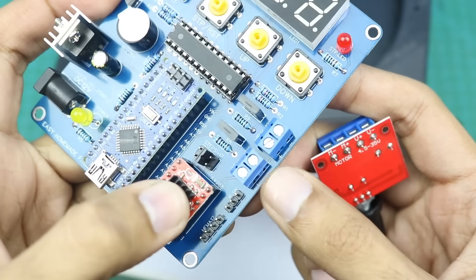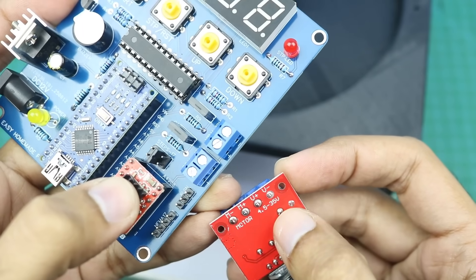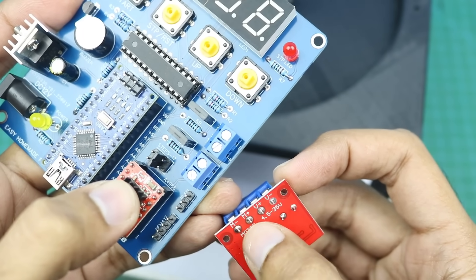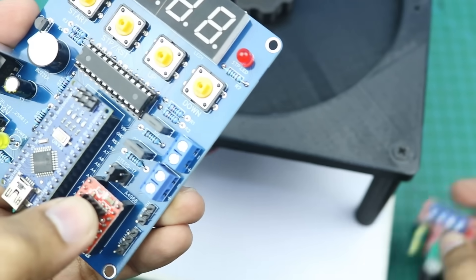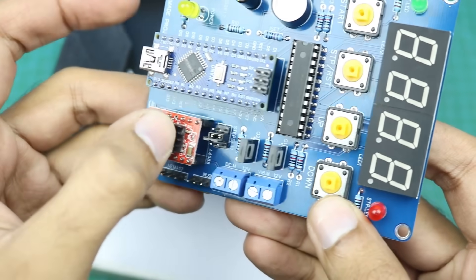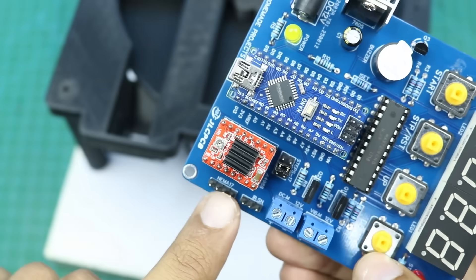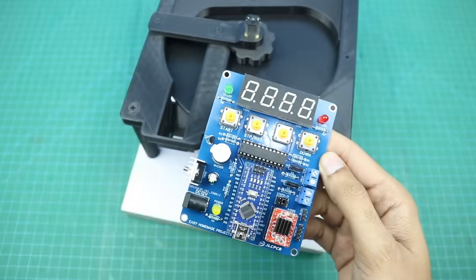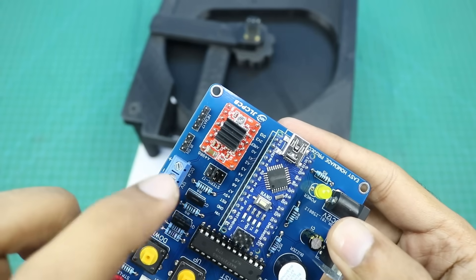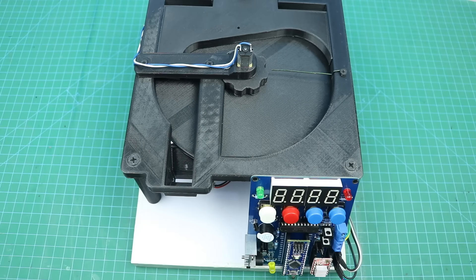The plus and minus from these two terminals will be connected here with V+ and V−, and then the motor wires will be connected here with M− and M+ with the help of these screw terminals. Similarly, the IR sensor wires will be connected here and the stepper motor wires will be connected here. We will also need to put a jumper here on the middle pins to make the step settings for the stepper motor.